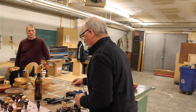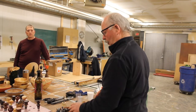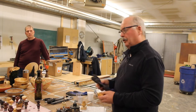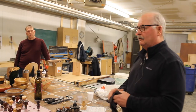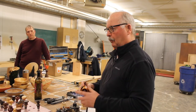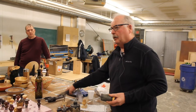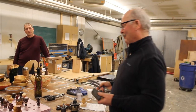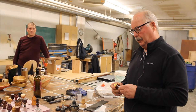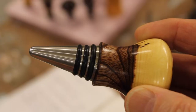When you're taking the stopper top off of these things, off your mandrel, it can be very difficult. Sometimes you can do it with a rubber glove — sometimes with two rubber gloves — and just wrap around it and try to pull them off. But quite often I use this chunk of old rubber off a tractor tire. Just wrap it around there and grab ahold of it. But make sure you've got pretty good rubber on there, otherwise you're starting over because it's very soft in the middle and it takes out all the threads inside.